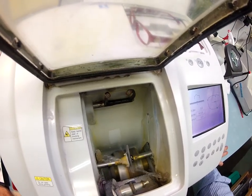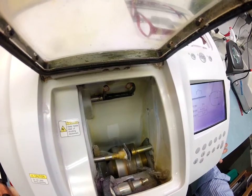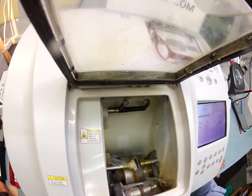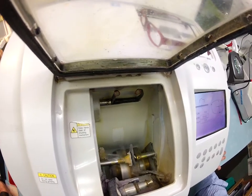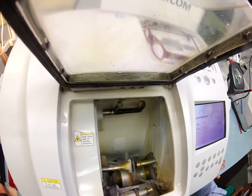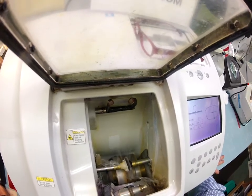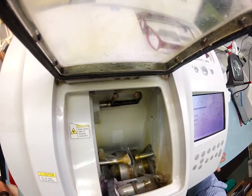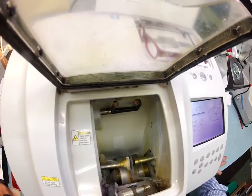The water is kicking in now. Notice it's been cutting dry up to this point — polycarbonate cuts dry; plastic and high-index cut wet with water jets spraying constantly. This water only happens in the very last cycle to wash away any optical debris. Of course, as soon as I take it out I'm about to put much worse debris on it, as you will see.